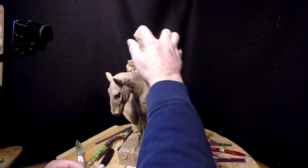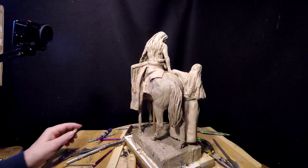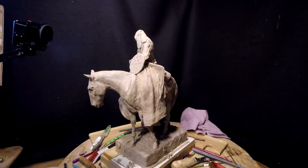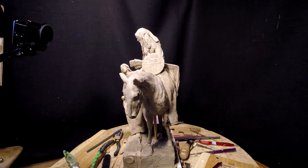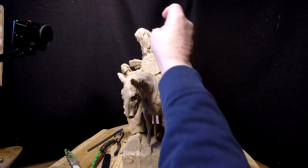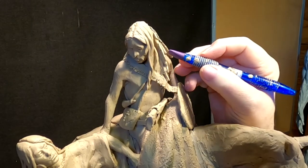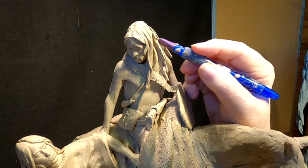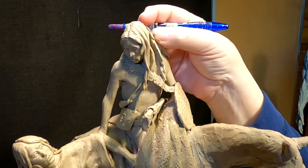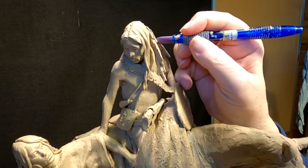What I did was I filled in underneath these two feathers. It'll just make it easier to cast, and I did it in such a way that it doesn't look like I filled it in. But you need them filled in because you can't have deep undercuts. The deeper the undercuts, the harder it is for the guy cleaning the bronze and getting it ready to be colored. You can't get all the investment out — the investment is basically the ceramic mold material that gets left behind in the mold making of the bronze.